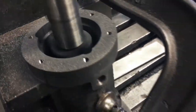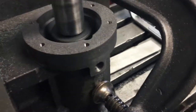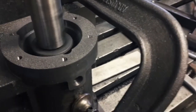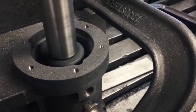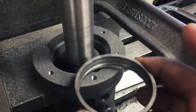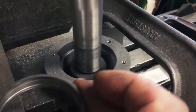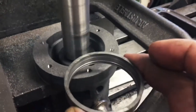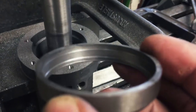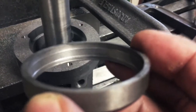Can't really see anything now. The boring head's on there. So what you've got is a fly cutter as a boring head. I have it set to the right diameter. I experimented. What I did was I put this ring, which is a piece of the sleeve, on that register, and then put a screw on it at two locations across from each other to hold it in. Then I test bored, as you can see inside, until I got the diameter at 2 inches,